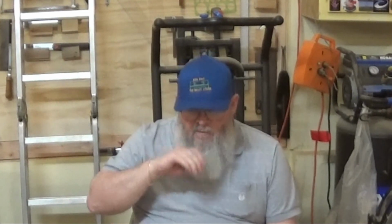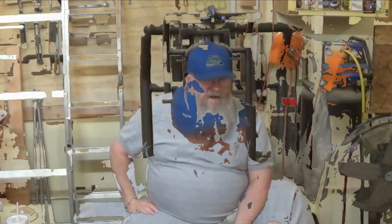You could, seriously, if you were to crank down on the tailstock with a piece between centers, you could watch the bedways bow. It was absolutely horrible. A non-variable speed, of course, you had to change the belts in order to change the speed, and I think the slowest speed on that thing was close to 500 RPM. Scary lathe.